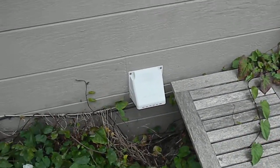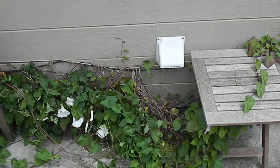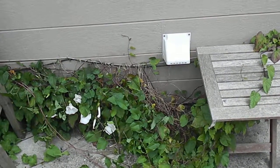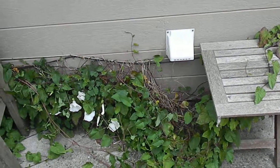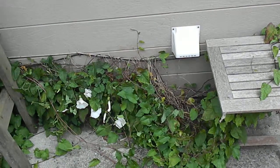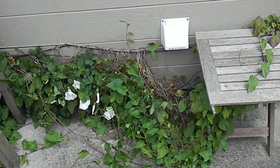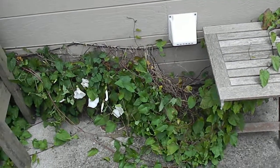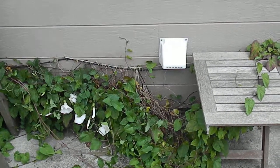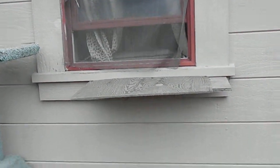That's my little video about dryer vents. You want to make sure the kinks are minimized, then check inside. It's always a good idea to turn your dryer on and check the flow on the outside. There's a mathematical formula, but basically I look for a good flow — I estimate it to be about two hair dryers blowing full blast. And if you notice that your clothes aren't drying as quick as they used to, this could be a problem. Make sure you've got good vent exhaust and good flow into the room.